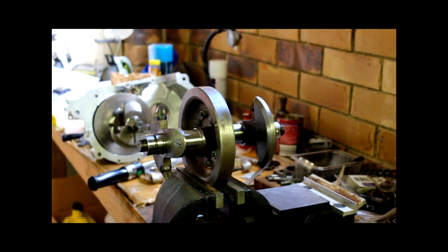It'll get enough residual oil going through to be okay. What'll happen is you're out with your mates on that sunny Sunday that you've been waiting all winter for, you're going for a blast. Nice big open straight road, wide open the throttle, journal starve of oil, engine seizes, you're picking up bits of alloy casing in bottom end and crankshafts on the ground and crying for a long, long time because you will never ever get new cases for these. It's happened too many times, they're just not around. Mark 1 cases can be found if you're lucky, Mark 2s much rarer.